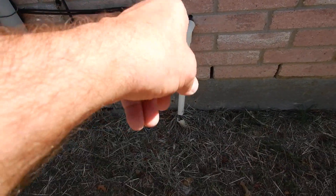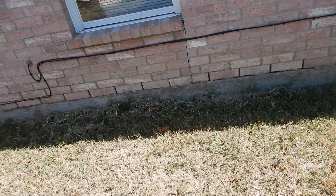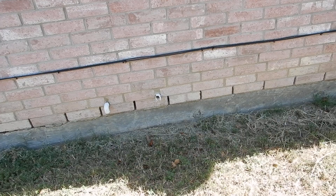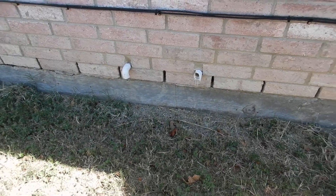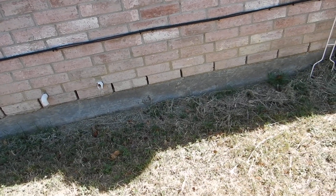This is the control wire conduit for the lawn sprinkler system. You see these little holes — that tells us this is a post-tension cable foundation. There are a couple of different styles: some have cleats, some sit more flat on the ground. The cables make the foundation a lot more strong. These are about the only cracks I've noticed regarding outside signs of the actual foundation.